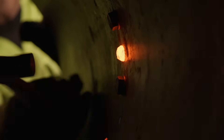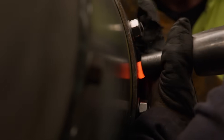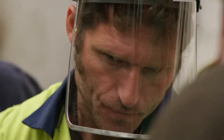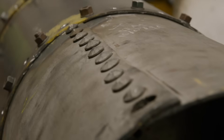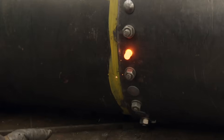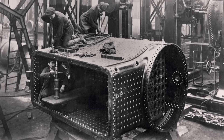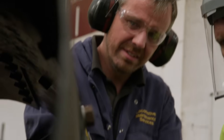Put it in the hole, put the press behind it, expand the press out. The vibrating gun vibrates the red hot rivet and splays it into the hole. Beautiful. Once you've riveted it up, let it cool down, so it contracts and pulls the two bits of metal together. Hot riveting enabled boilers to withstand unprecedented pressures and produce enough power to move their own weight and tow a train of wagons.